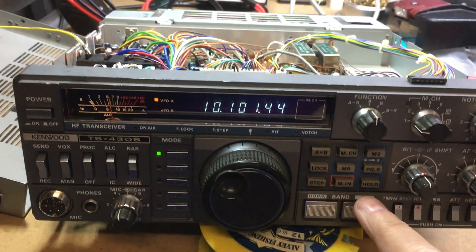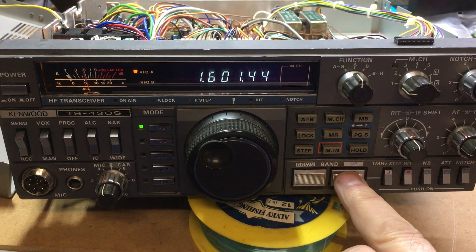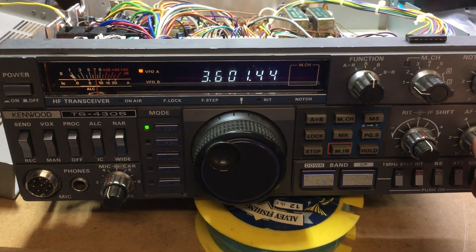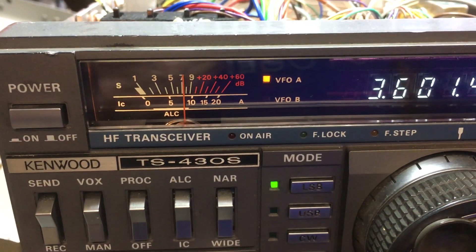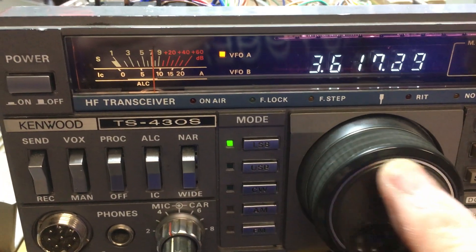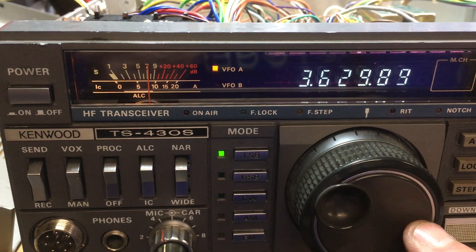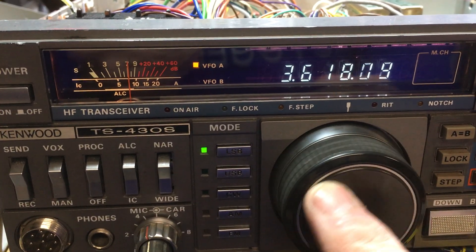Now I have got an antenna plugged in here — a 40-80m antenna — just for the purpose of the exercise I'll run through the bands, starting at the top band and also 1.6. With volume on full blast I'm getting a heavy static, which isn't surprising for the 80m band, but there are no signals that I can tune. As you can hear, I'm tuning through the 80m band — in Australia that's down from 3.5 to about 3.665 or so, which is the frequencies people tend to use and where the nets gather.